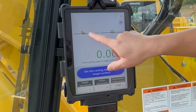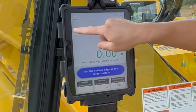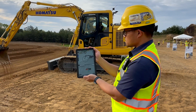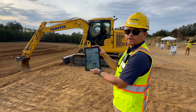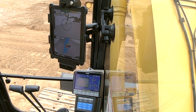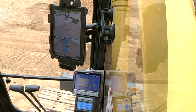This blue line is indicating where that target grade is. You can see where the bucket teeth are — where that cutting edge is — it has built that surface based on where the cutting edge is. As the operator is making the digging motion and the machine is approaching target grade, it gives an audible indicator as well as a visual indicator so the operator can dig only what's needed.